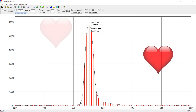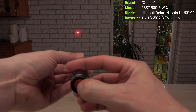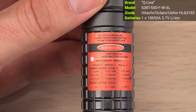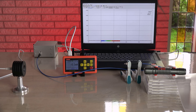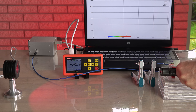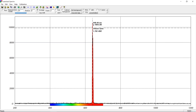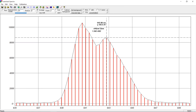Click like to celebrate it with me! Switching from precision to power — it is time for the big boys. This next laser is not big physically, but don't let its small size fool you. While its wavelength may be close to the helium neon laser's, its power is not. It has a multimode laser diode, so forget about beam precision. On eBay it is sold as being under 5 mW as usual, but labeled as under 500 mW. It is actually a 700 mW class 4 laser. The spectrum is relatively wide with two almost equally strong peaks — typical of a multimode diode.